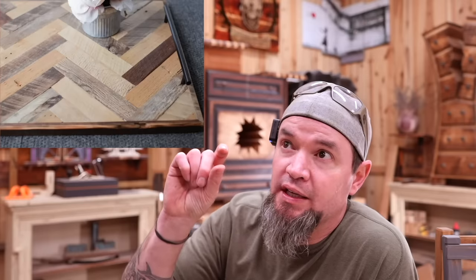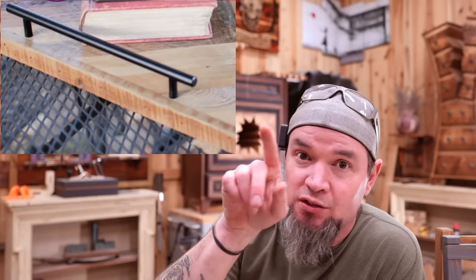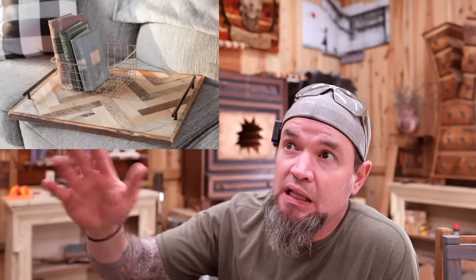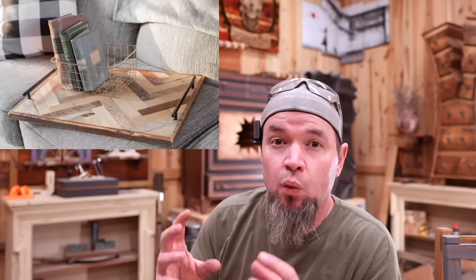The handles come in a 10-pack for $13 — just over a buck a piece. Glue all the herringbone parts in place, let it dry, flip it over and put brad nails in the back for extra hold. The edge trimming is about a half inch thick and three-quarters of an inch wide, glued and brad-nailed down. What gives it the softer look is a whitewash — just thinned-down white paint or white stain. Glaze the top, wipe it off, and it hangs in the saw marks and corners giving a white glazed hue. Finish with urethane. These things are super nice — not $250 nice, but for less than $5 in material, price accordingly. At $75, people will buy them if you can replicate the look.